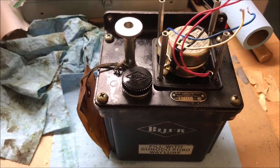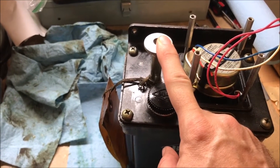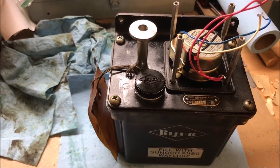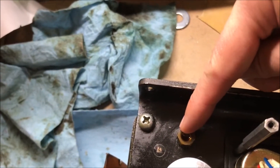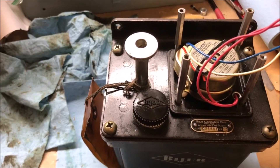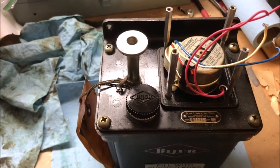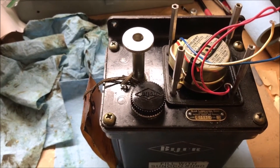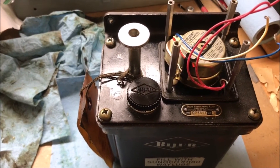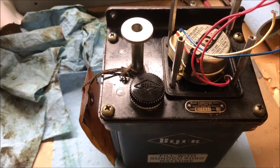Here's what I know about it. This is the fill cap. This is a manual pump — if you pull up on that it'll do a single pump of oil. This here is the outlet where the oil gets pumped out. This little motor here is on a cam of some sort with gearing, and it spins, and once every 30 minutes it pumps a squirt of oil.